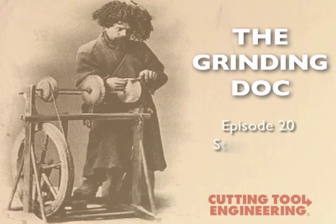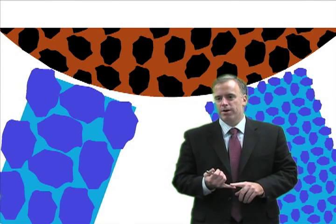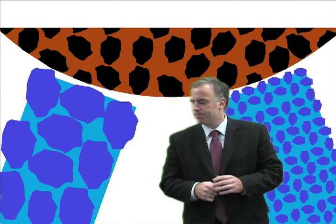We grind tungsten carbide with a resin-bonded diamond wheel. We buy conditioning sticks from 2 different suppliers. With one stick, we can go a lot more parts between stickings. Why is this? The biggest mistake people make when they're using a conditioning stick, or sticking their wheel, is that they use the wrong grit size.